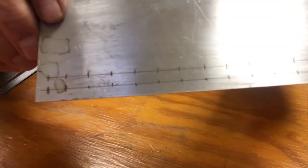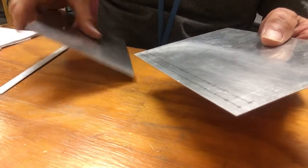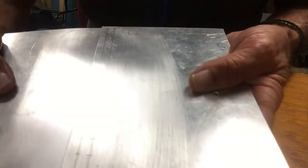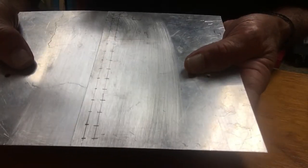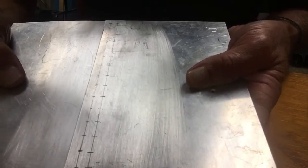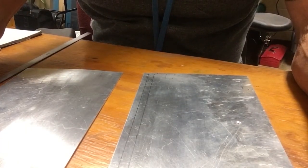Let me try to hold it up there to make sure you can see those. So I've got 30 rivets in 2 rows, 15 rivets per row. And now in order to splice these sheets, what I would do is overlap these sheets, drill holes, and then drive rivets — and that would be my splice. Splicing 2 sheets together using 2 rows of rivets of 15 rivets per row would meet the design criteria of what we're after. So hopefully that concept helps you.